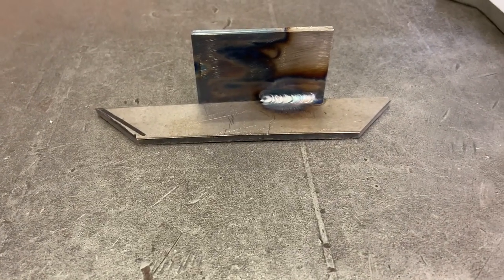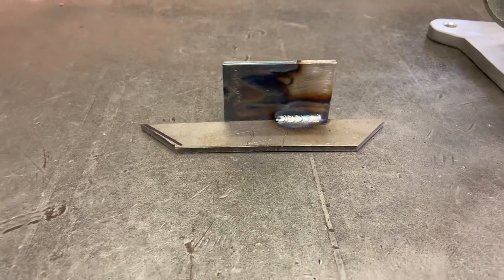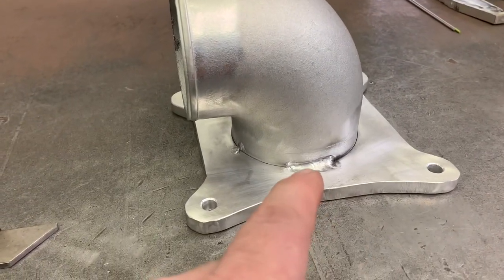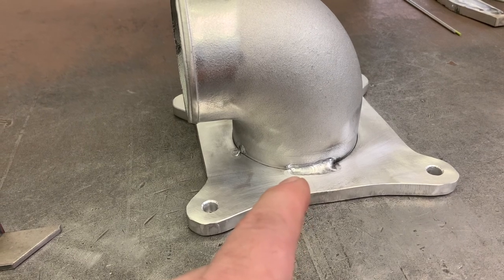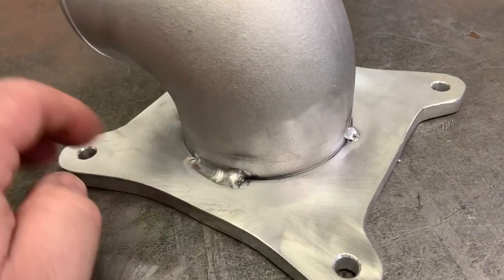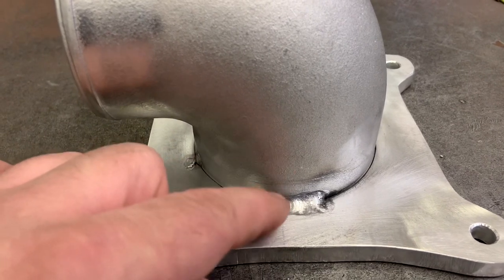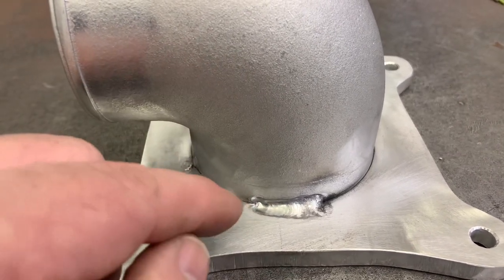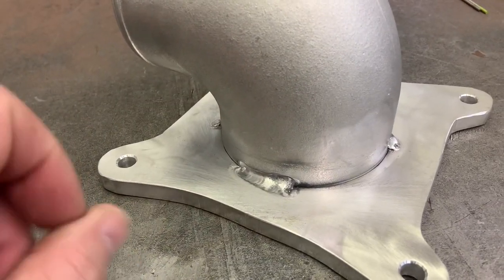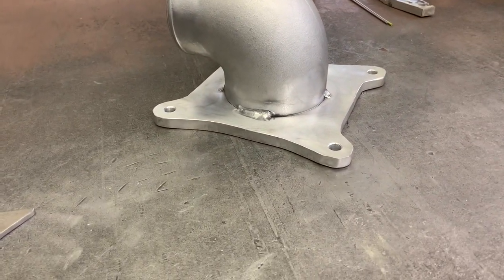It's a completely different experience than the transformer machine I'm used to, and I think I like it a lot. It's hard to describe — it's just milder. It's not as much buzzing and extra noises. It just pops on and starts welding. This is 120 amps, welding two pieces together — that's more the color and finish I'd be looking for. Just because I can't leave well enough alone, I dug out the Lincoln again and was able to at least start a bead on the old snorkel here, but the Alpha TIG doesn't quite get hot enough yet. I messed around with the Alpha TIG with every color tungsten that I had and really got nowhere.